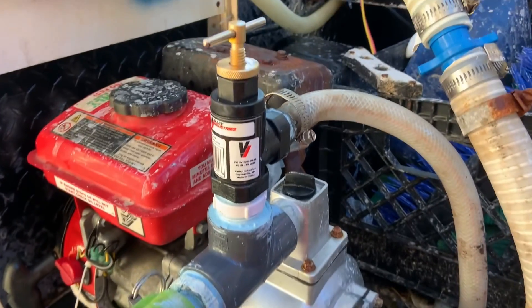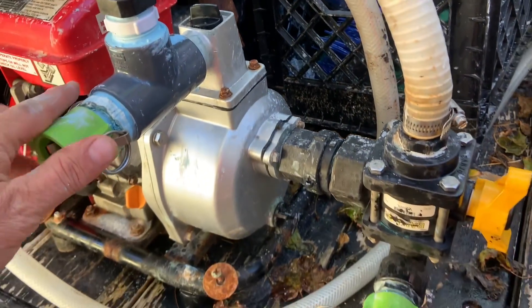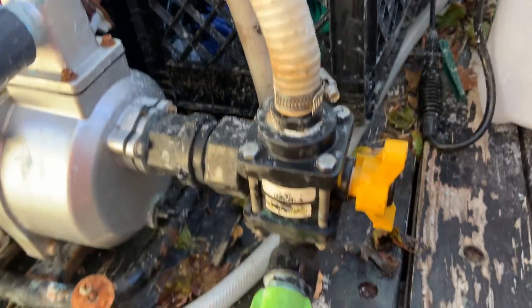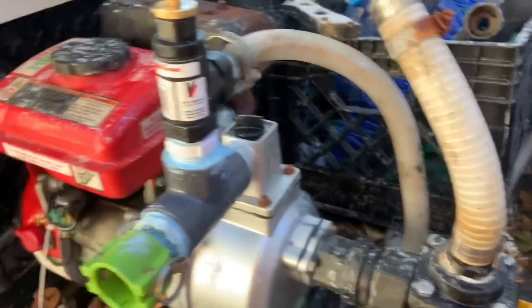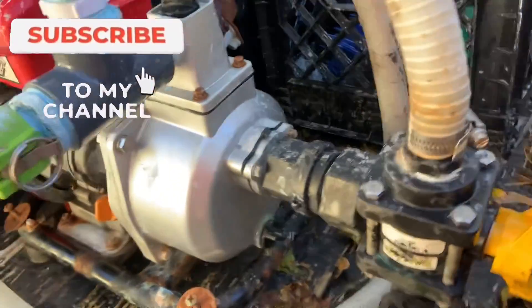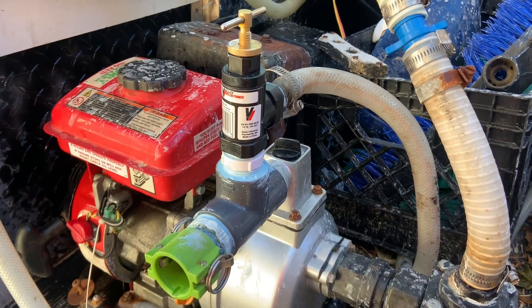Like I said, this is just a band-aid for it. Hopefully it doesn't blow these plastic caps off when the pump gets hot. Even with this setup, you shouldn't be off the gun for more than about five or six minutes at the most — same as any other pump, even the Comet P40s. But the bypass should help. We'll see how it does up here. We'll catch you on the next house wash.